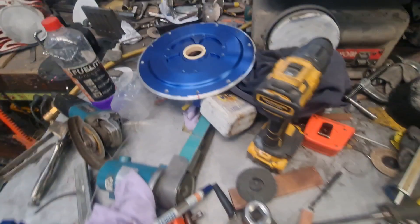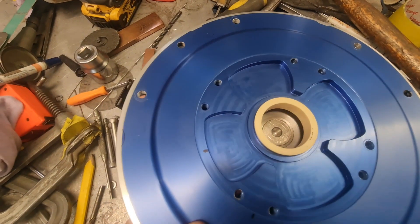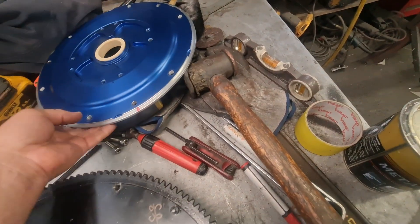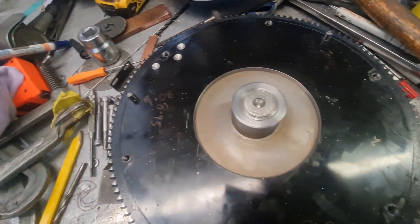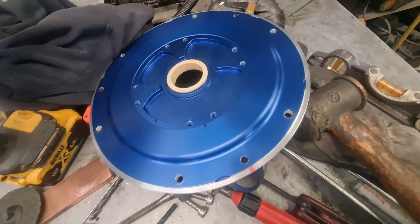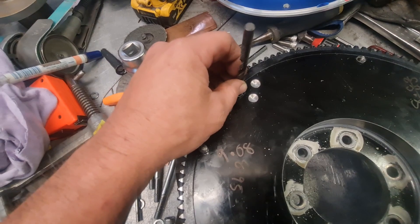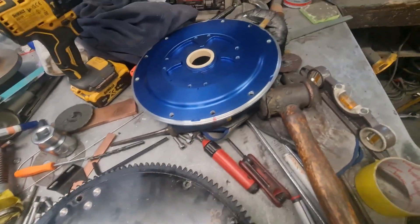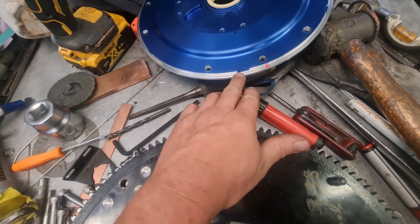It's nice and snug, and it was fitted over that but without the plastic piece, which is also a great fit. Then I clamped it together with the dowels out and drilled it from behind. Once I got the dowel holes in place, I put a drill through and used it like a dot punch — tap tap tap — and that gave me my marks. Then I was able to clamp it together on the lathe.